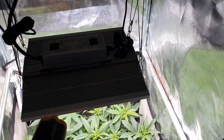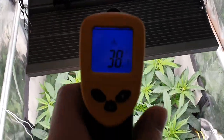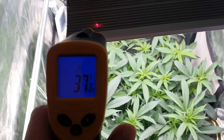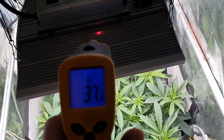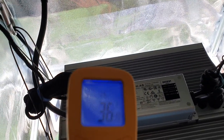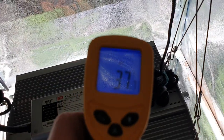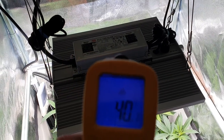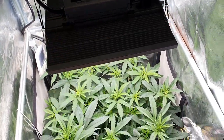We'll take a little measurement from the back here — hopefully you guys can see this. On the back of the heat sink we're getting 37, 36 degrees — that's all pretty steady, quite comfortable with that. We'll go over the other side just to check both sides; it's just one quantum board so it should be pretty even. Looks good, and the driver's running at about 39-40 degrees. Happy with that.